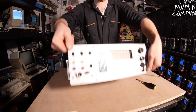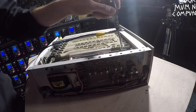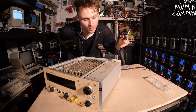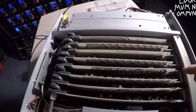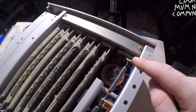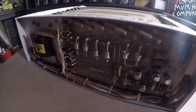Oh, the dust — wow, that's dusty! The first thing I'm going to do before I go rooting around is discharge these capacitors, because that one looks awfully scary. Remember: if you're going to be dealing with high voltage, always keep one arm behind your back because it won't go through your heart. We've got the screen and it looks like every single one of the Nixie tubes has two boards. I have a sneaky suspicion that the plus/minus one is actually controlled by a relay, because I was hearing relays when it was changing. There's the power supply, some nice old-school diodes, and some really pretty shiny things I must profess I don't really know.